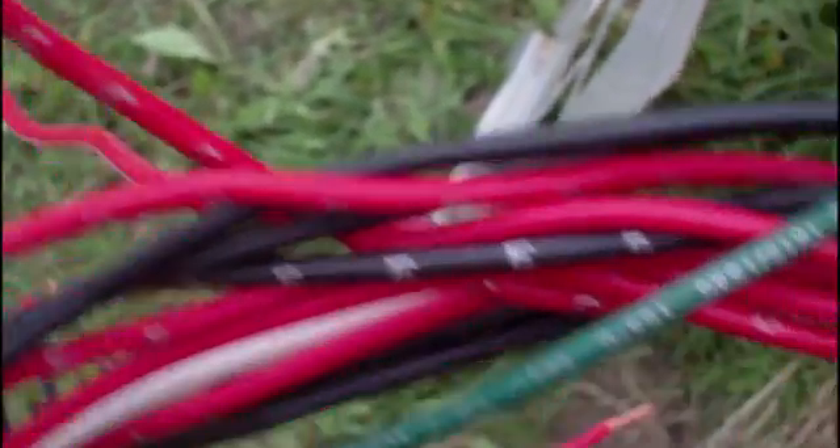The way that works is you find the wire for each letter — there's a black one and a red one for every letter. So you find the black C, and then you find the red C somewhere in here. Here's a red C right there — that goes with a black C, and that goes to the breaker. This allows you to have regular power on most circuits and isolate one or two circuits to go to battery. This is Mike the electrician doing the work right now getting this stuff connected.